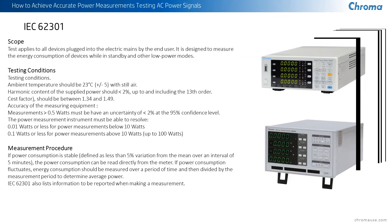Confidence level and uncertainty are very low — anything above half a watt requires less than 2% uncertainty at a 95% confidence level. This is a test performed over a number of different measurements over time, and they look to see that measurements stay within their accuracy based on this level of testing. The confidence level means that if you ran multiple tests over time, there would be a 95% confidence that they would always fall within that certain level of accuracy.